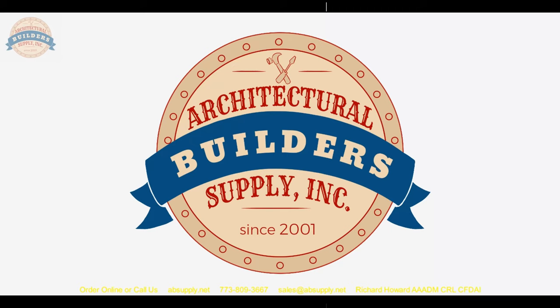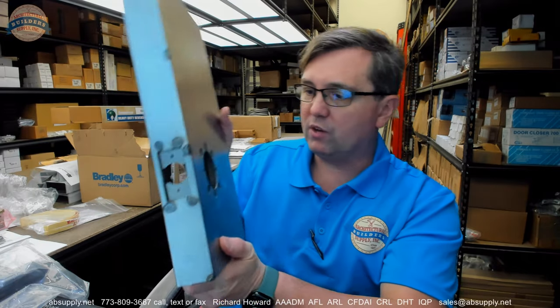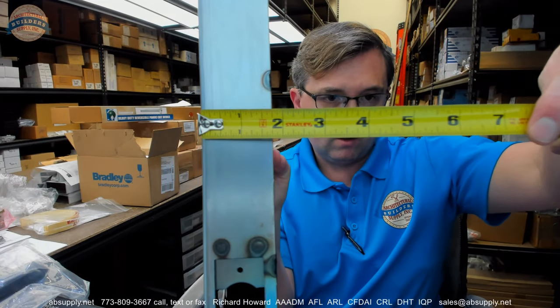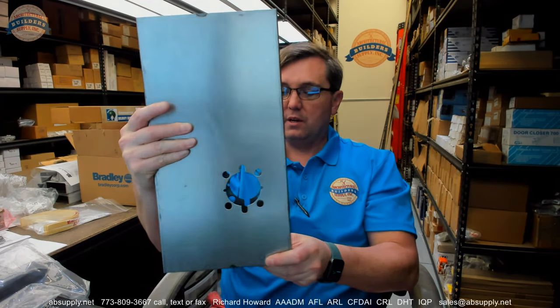Let's wrap up this video on camera. In conclusion, that small difference in dimension aside — not a big deal for this client. They've got plenty of real estate up here to get that lock installed. We're going to make sure they're okay with it before we ship — there is a deviation, and we're going to make sure all parties involved are okay with the deviation. The thickness ought to be about an inch and three-quarter — and it is right on an inch and three-quarter. So the edge prep is two and a quarter by inch and an eighth, and two and an eighth inch is the cylindrical hole size. When you're integrating some access control, this could be a very appropriate big piece of real estate. For electronic access control, you're going to need to drill a hole through the back of the box somewhere, connect your conduit, and there you go.